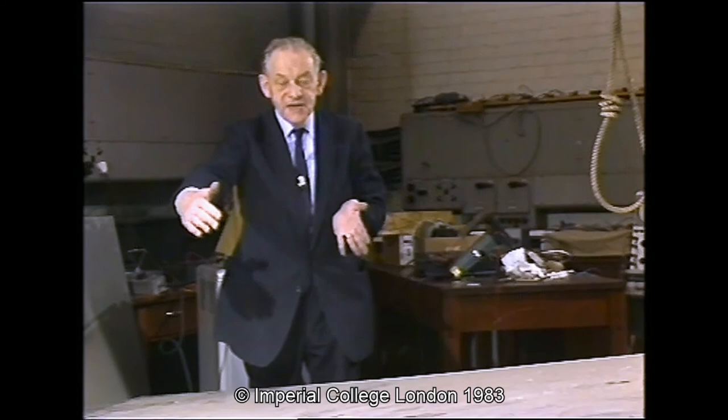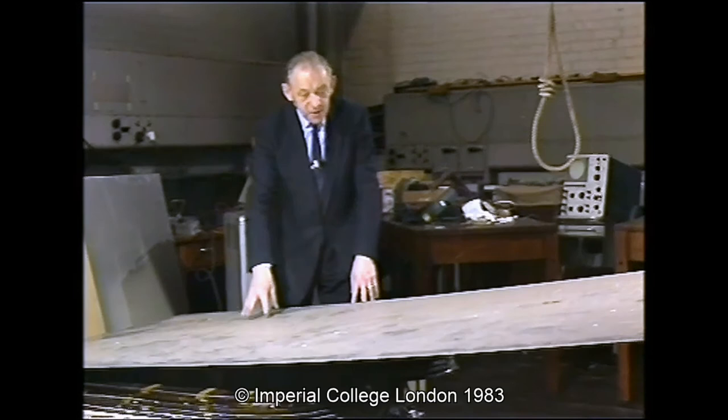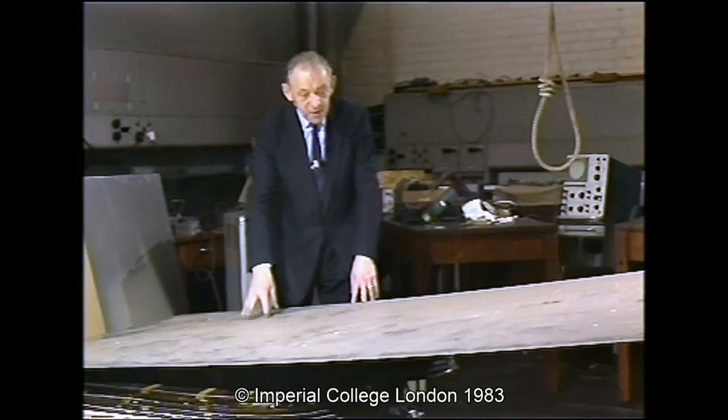When we have a bigger voltage available and put the other nine coils on each side, we confidently expect to lift this to two feet and the lateral stability will have increased until it is a completely hands-off system. Remember also that this is taking the whole weight of the plate with only one unit, and there are to be three units — therefore there will be ample lifting force to lift 200 pounds in addition to the weight of the plate.